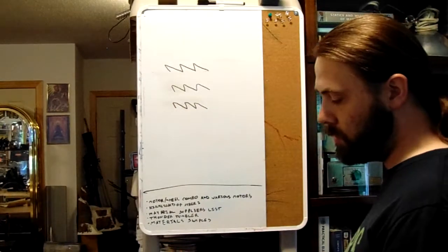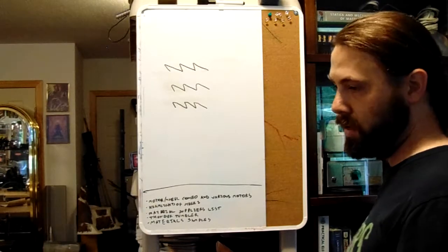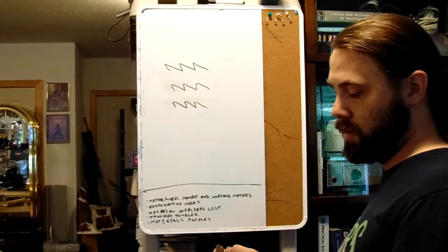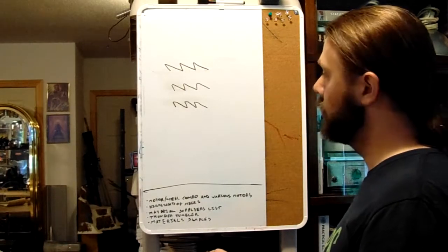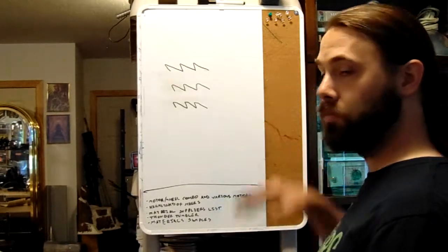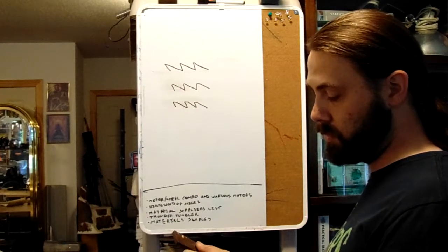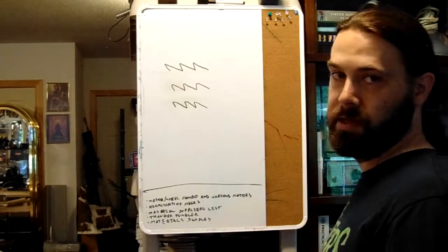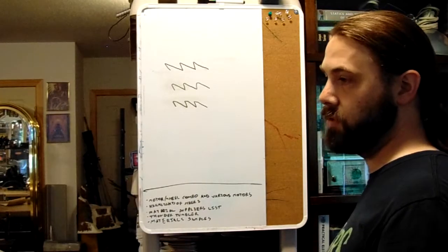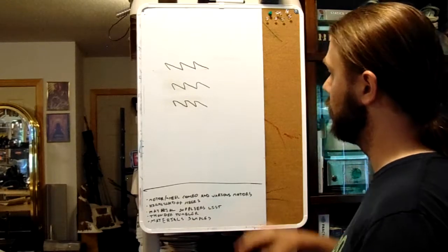Now you can do this 2 to 3 times with a good file. And this is coming straight out of a book written in the 40s that I learned a lot from. It's one of my highest regarded books when I was learning how to machine. And this works. I've done it. I buy these old files all the time, and as long as they're not chipped up, I usually can get at least 2-3 sharpenings out of them. Most of the time, if I sharpen a file, I can use it for years before it needs it again, if you don't drag it backwards.